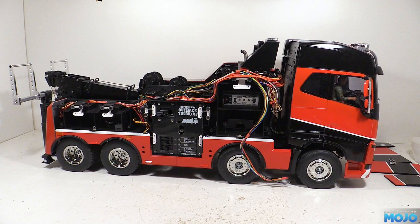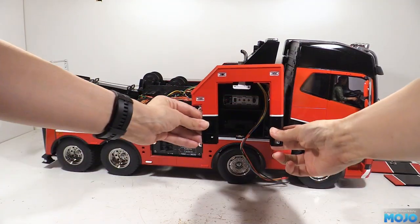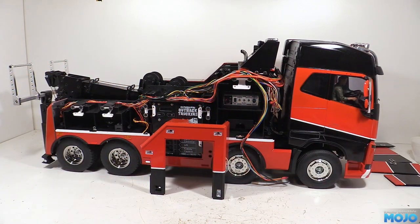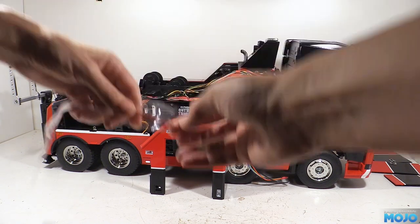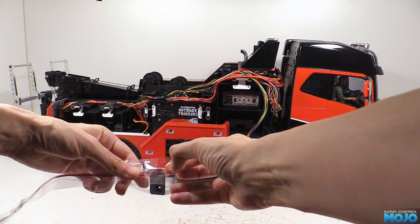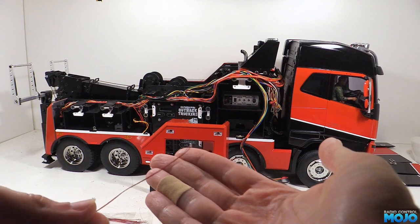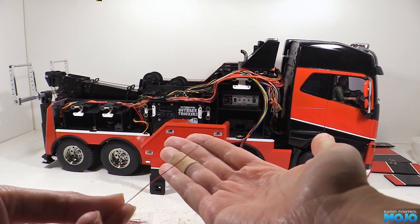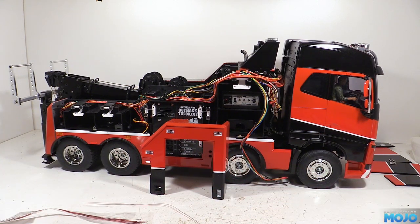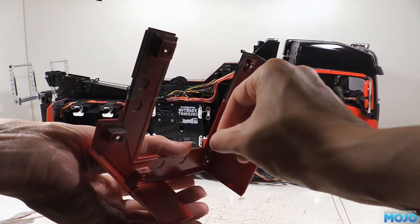This time we're going to be working on the two top sections of the rear body, concentrating mostly on the front one, as once we've fitted one panel or the LEDs, the rest is pretty much all the same. For the marker lights, I'm using yellow 0805 surface mount LEDs that have been pre-wired. Basically, all that's been done is there's a red wire soldered to the anode and a black wire to the cathode. Not at all difficult to do yourself, but they're cheap and I'm lazy.